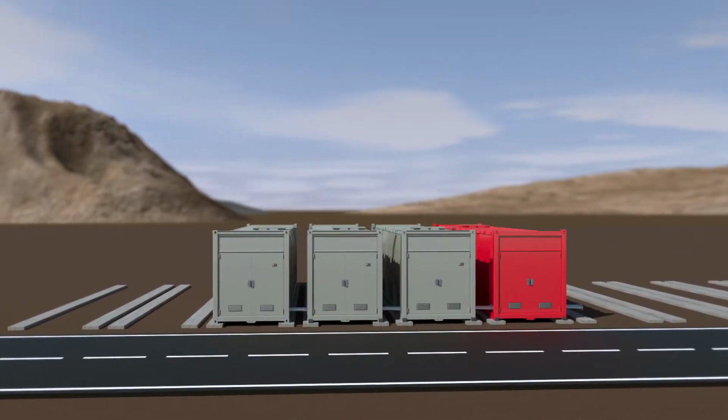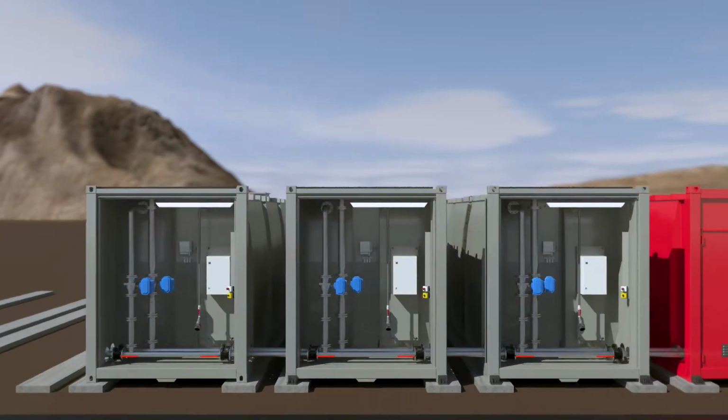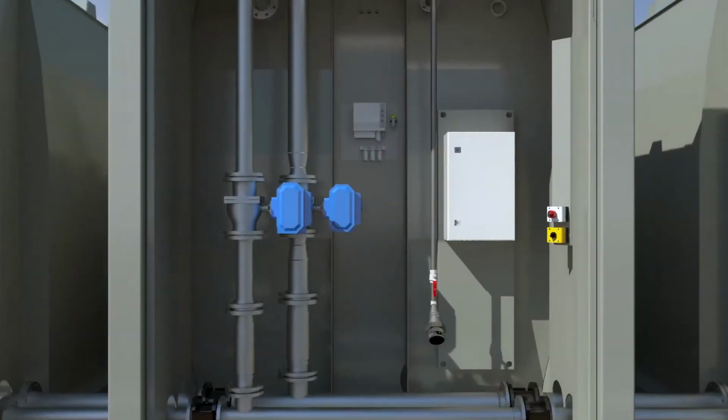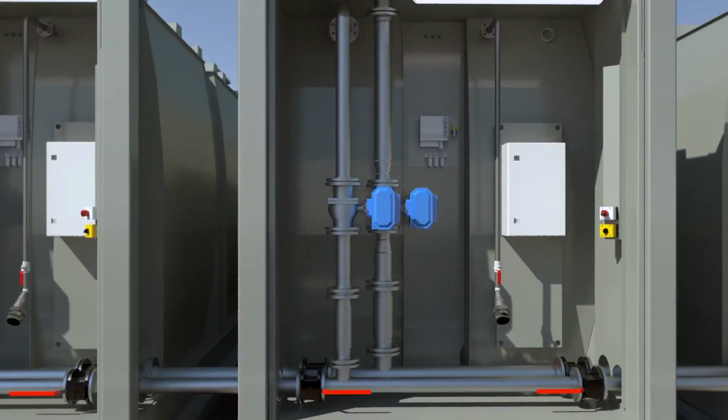The filling and emptying of the containers runs through the collecting pipes. In and outlet is regulated by motorized ball valves switched by the control module in the worker. This control module is subordinate to the central control in the administrator.